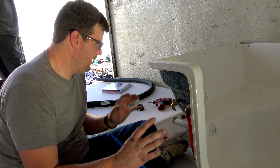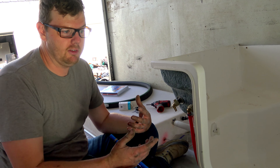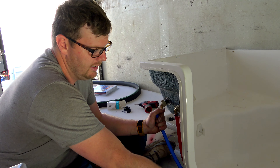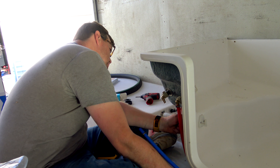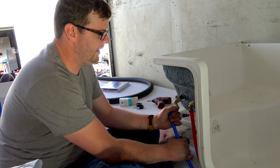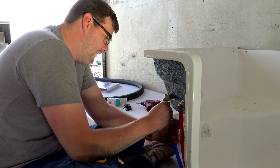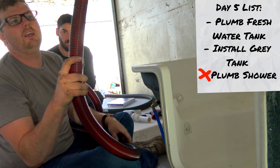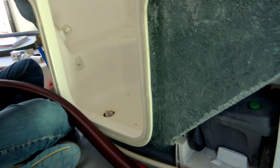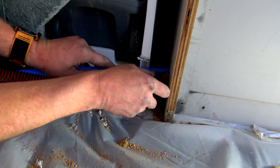We're doing the PEX on the bathtub. We've got our main PEX that comes in — this is our city water line. One nice thing about PEX is you can take these bends in it pretty easily, and if it's stiff and you don't want to be too hard on your connections you can just put some bracing on it. It saves you from having to use a lot of PEX fittings, elbows, bends, and 45s. I also got this vacuum hose to run diesel heat ventilation, and since it's running in the same trough as the PEX lines, it will help keep them warm.